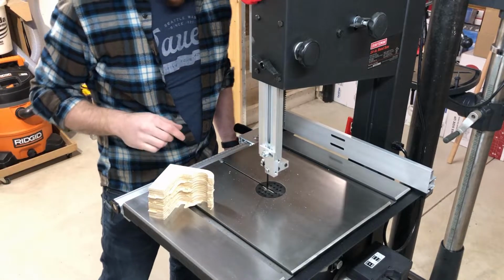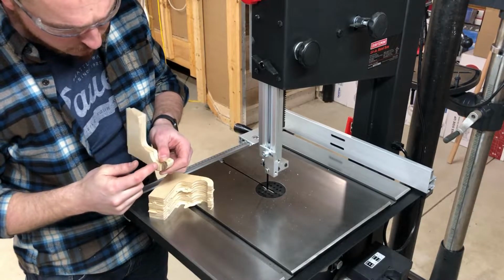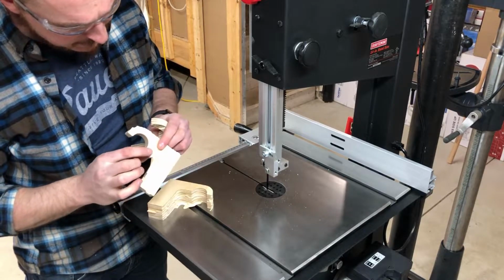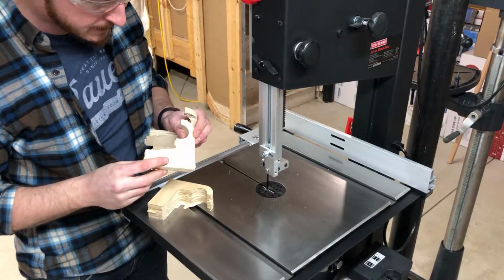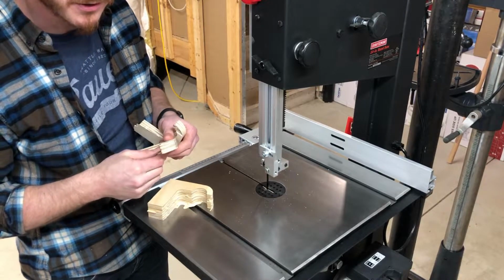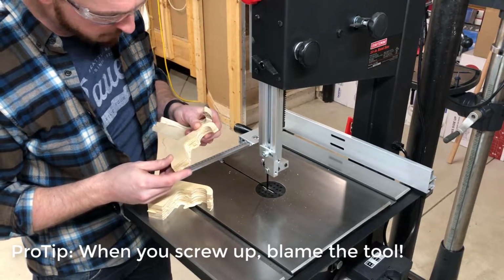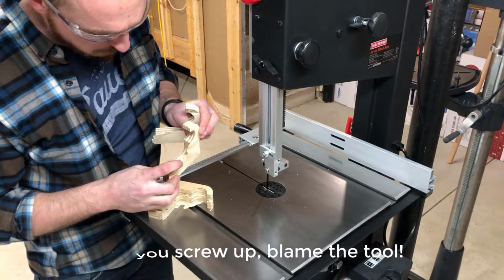All right, guys, you know what? I tried peeling some of this back, and I actually broke some of the veneer. There's so much material left on these. This was a really weird piece of wood. Either that or my caliper was not correct. It's one of those digital ones from Harbor Freight. It's about $6, so it's certainly not the most accurate thing in the world, but definitely went way shallow on this. There's some pretty decent material left.